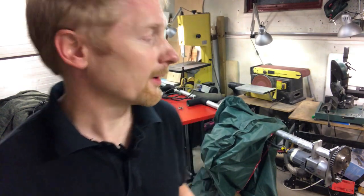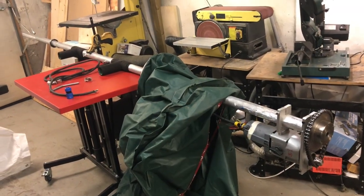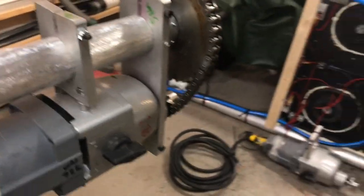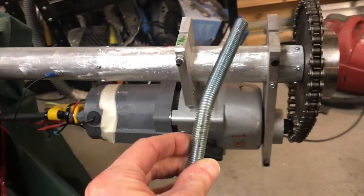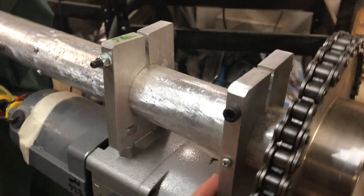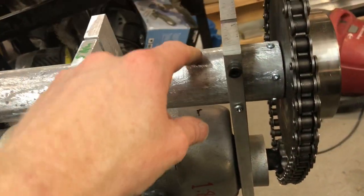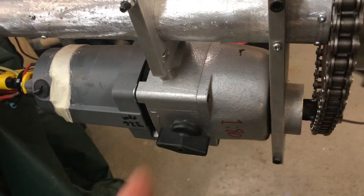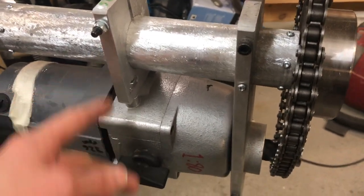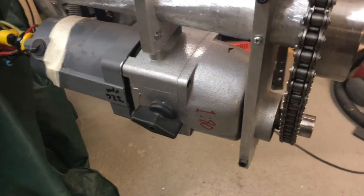Let's start with checking out the front axle of the inflatable car. Here you can see it in its entire length. The motors are positioned farthest out. Since the test in the garden where I could with ease bend this 12mm threaded rod, I have updated the clamping of the motors with an extra screw from both sides, giving a more positive grip on the axle. The screws are actually going into the aluminum tube. The magnetic field inside these motors is like a hammer — super super strong.